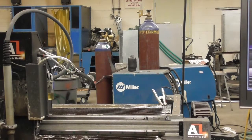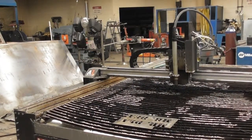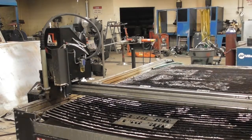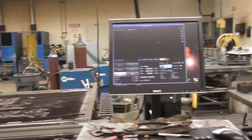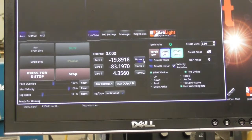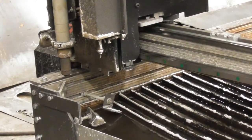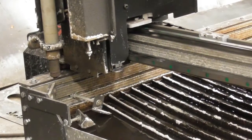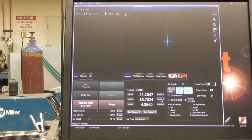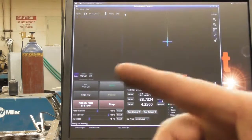The very first thing you want to do every time you start the machine — every time you get ready to make a cut — is to home the machine. I get it close to that point, then I'll hit Home on the computer itself. You can see where it's got Home X and Home Y. What that has done is taken it to the beginning point — the lowest left point of the cutting table. That's important because now the machine knows where it's going to be active from. That's the lower left corner of a sheet that we could cut. I'm going to put an object on there to cut, and then I have to zero it relative to the place I want to cut.